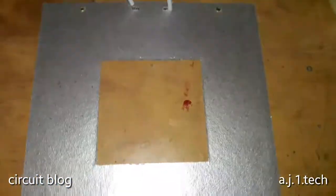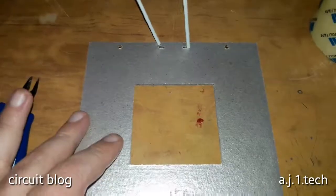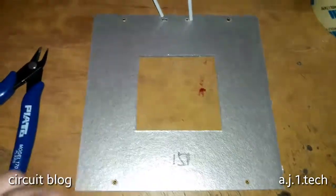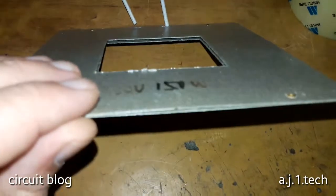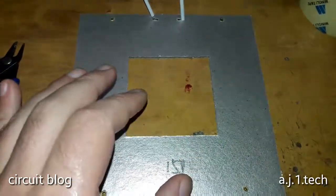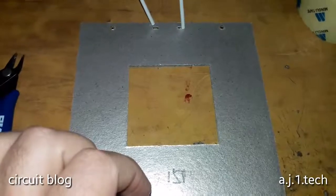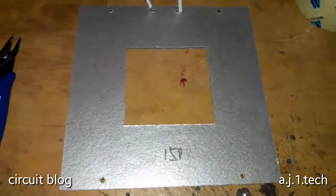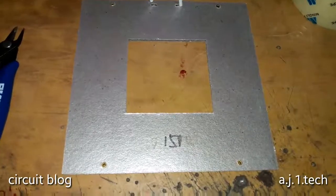So I tried to find a replacement for this heater and I couldn't, so it is not available in our market. So what I'm going to do is try to remove these brass rivets. As you can see, they are holding the two mica sheets together, sandwiching them, so I can open and separate the two mica sheets and see why the heater is disconnected. There is a broken wire inside of it. So let me remove these rivets and see if I can fix this heater.